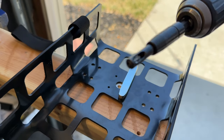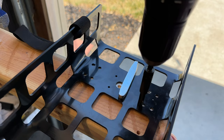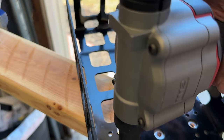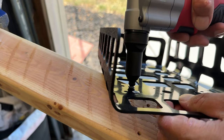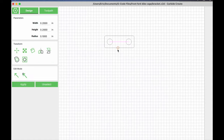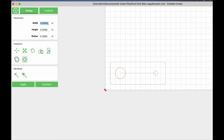I'm using this centering drill bit to match drill the holes in the plastic into the aluminum backing plate. Skipping ahead, I've drilled out the holes to match the large size rivets that I'm using and installing all the rivets. This is what all the pieces look like so far. That one bracket on the bottom with two holes looks really ugly, so I'm going to design a fixture to hold it and machine it down to be a little bit smaller and lighter.